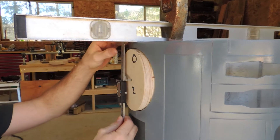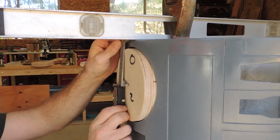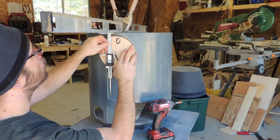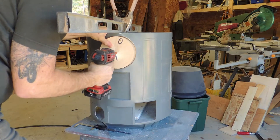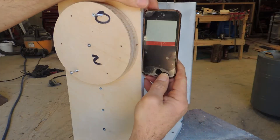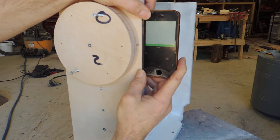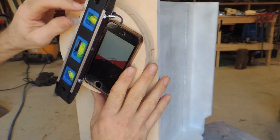I temporarily mounted the frame inside the body to ensure that I could line up the shoulder flanges properly. This alignment is critical to be sure that the legs would be parallel and at the proper angle front to back. I know that the sides of the frame are parallel, so I use a straight edge and a caliper to match the center height of the shoulders. I also know that the legs will need to lean back at an angle of 36 degrees measured from the body.